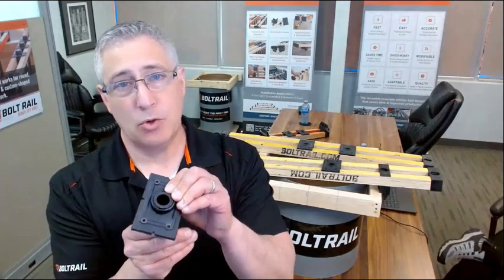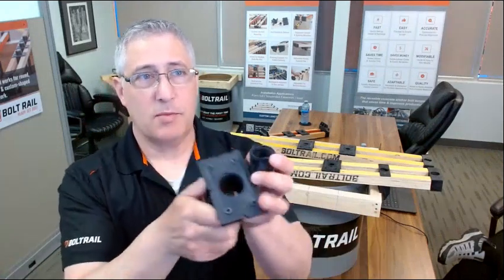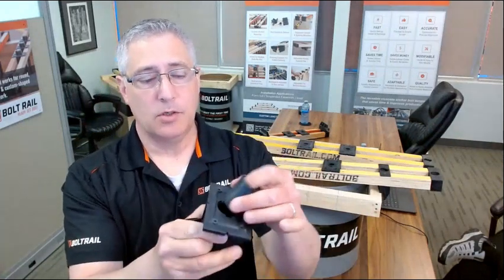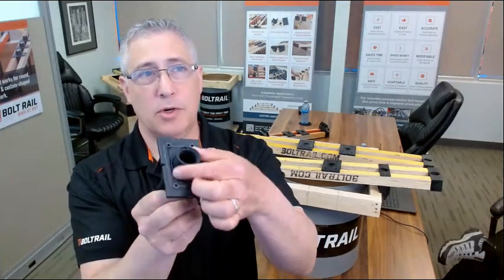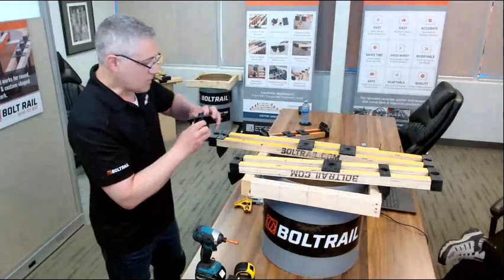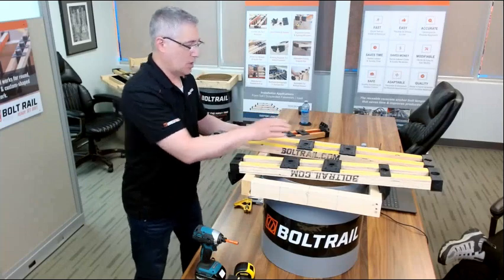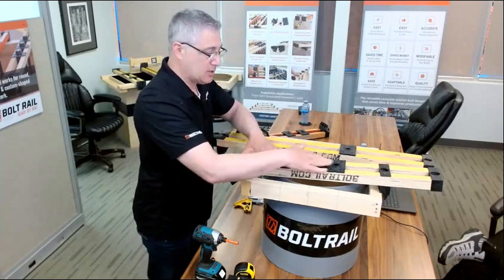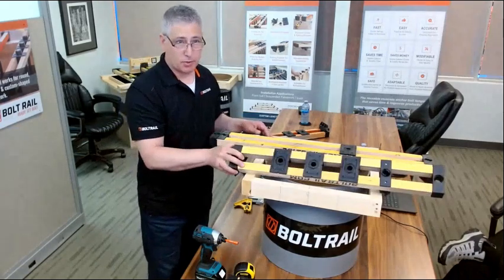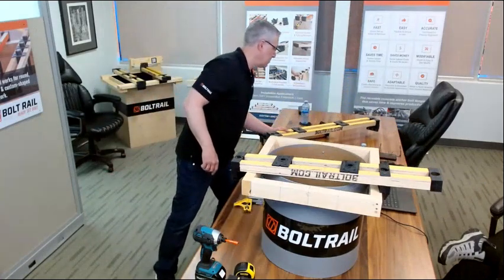This will go from a 3/4 inch hole to a 1 inch hole to a 1 1/4 inch hole without picking up a tool. So it'll do 3 bolt sizes. 5/8 bolts also work just fine in the system. I should also mention, we can add as many holders into the rails as we need if we're doing 6 or 8 bolt patterns. So it's really flexible in that regard.